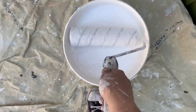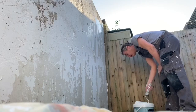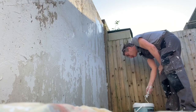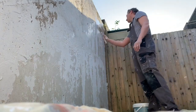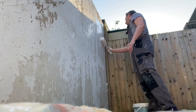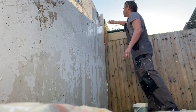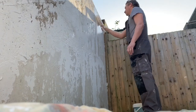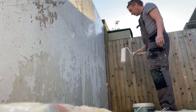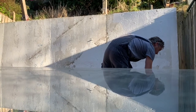You'll see me doing this quite often, especially on bigger jobs — I'm rolling straight from the bucket. It makes a lot less mess with extra tools and if you're careful you can keep it clean. Give your roller a good coat all the way around. Make sure you scrape it off on the end of the bucket as you move it away, otherwise it'll drip everywhere. This is why we didn't do the top edge with a brush — keep your roller flat and just let it overlap by an inch or two and push it into the corner. That'll be fine.